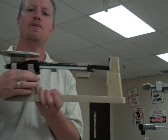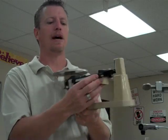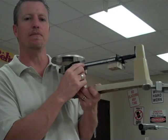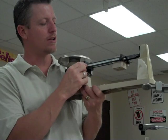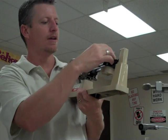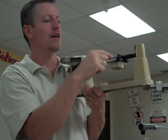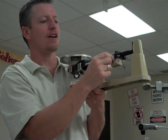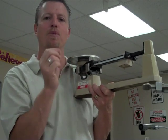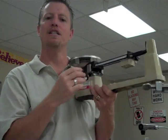This is a triple beam balance. Triple beam balances have three beams. It goes from zero to one gram on the smallest beam, but there are little lines between measurements — each line is 0.1 gram. The large weight goes to 500, one goes to 100, and one goes to 10, so adding them together: 500 plus 100 is 600, plus 10 is 610, meaning this is accurate up to 610 grams. We can measure something as large as that or as small as 0.1 grams. Anything between, like 0.01 or 0.02, we have to estimate, but it's a small and pretty accurate guess.